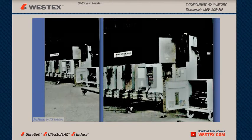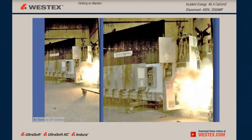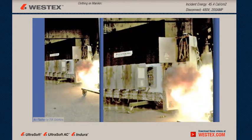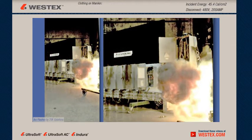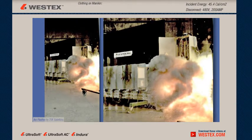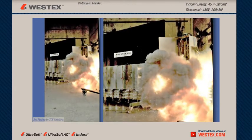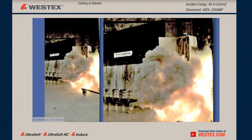Let's take a look at this now in slow motion, 3000 frames a second. What you notice is that the arc begins in the rear upper portion of the cabinet, but that once it projects from the cabinet, it just keeps getting further and further and further away from the arc gap itself. The arc ends up in the neighborhood of 10 feet projected directly out in front of this piece of equipment, and the molten metal considerably further than that.